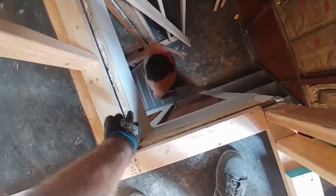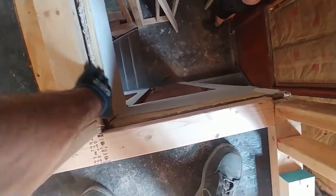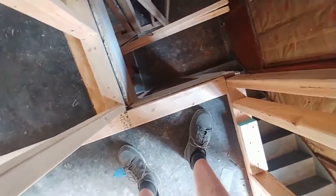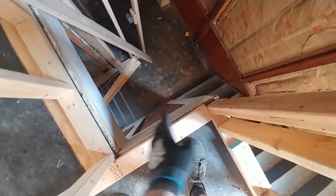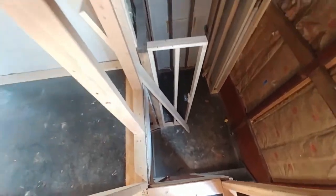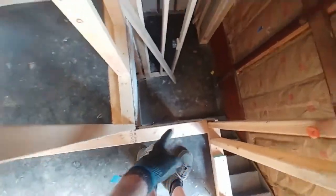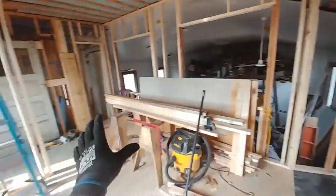Where Brad's coming through, we're going to put drywall on this framing, but you want the face of the drywall to come into this and be something that you can finish and that disappears. So I was so careful to make all this framing come in a half an inch from the face of this plaster, even though the plaster's thicker than the drywall is. So we get all done here, and I'm looking for this area to be a closet in this bedroom.